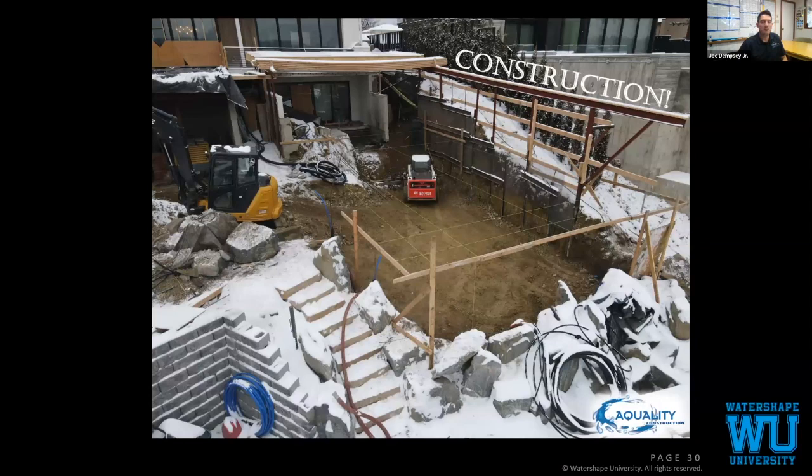So construction phase begins. They're excavating down. They have geothermal in this hillside, so we decided to go with micropiles, and then every 5 feet, they welded a steel mesh and steel beams to the micropiles. The micropiles also go all the way up to support this beam, which the general contractor built a building over for us to work through the winter, since it was obviously snowy.